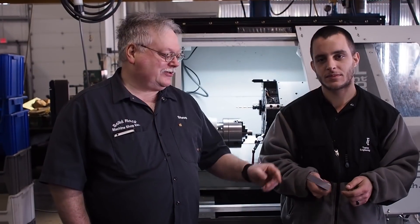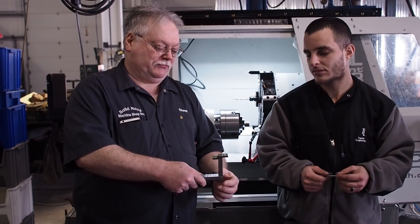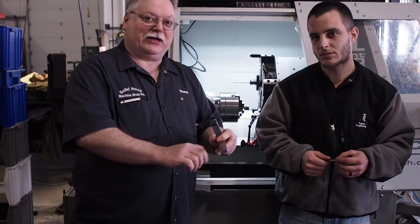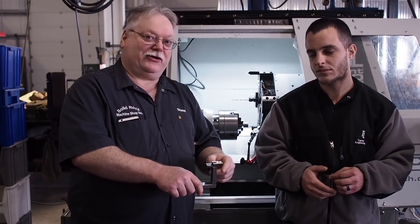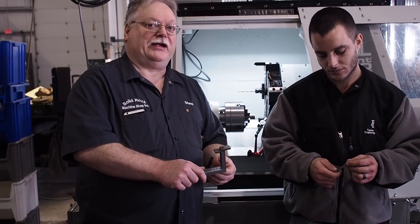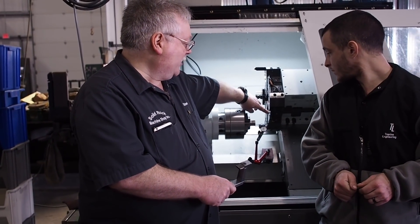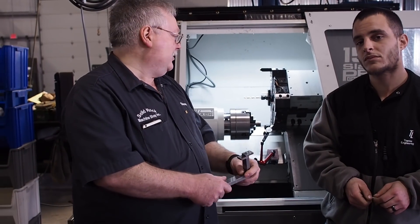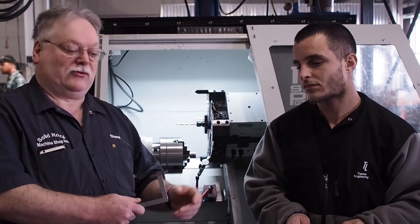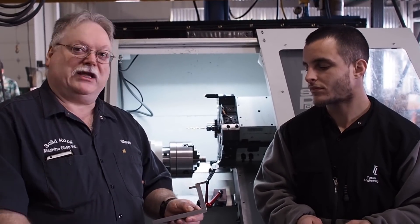This is a nice little tool. You can make these with different heights if you've got multiple tools, and you can make them for different lathes. Works nice if your saddle's flat; here we have to make the clamp. It'll work by just rotating 180 degrees for tools that are right side up or upside down. It's just a nice, fast way of verifying the center of your spindle with your tool. In this case it was a thousandths off — if you wanted to put it to perfect center, you'd need to add a thousandths shim. Be sure to check out Mike's website. It's a little two-man shop here in Holland, Michigan. We'll see you next time.